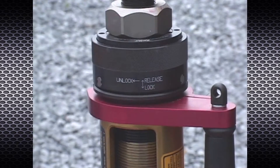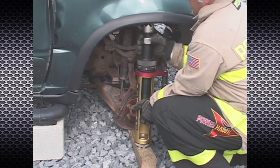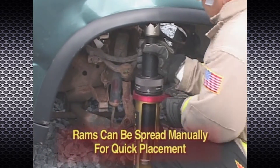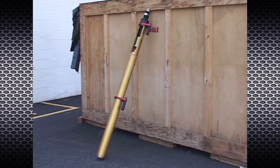The Power Pusher's unique Zipnut Double Zip feature allows quick and easy operation for safely holding the working load. The Power Pusher may also be extended by hand for stabilizing and shoring in seconds. A wide range of spreading distances can be achieved by using the secondary extender, connecting two Power Pushers back to back, or by using optional extension accessories.